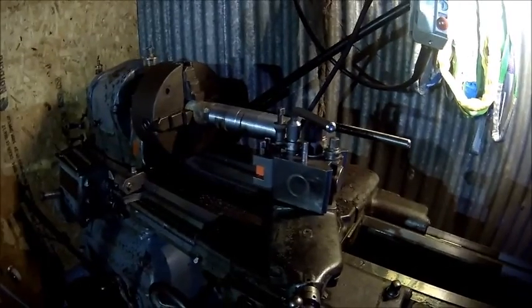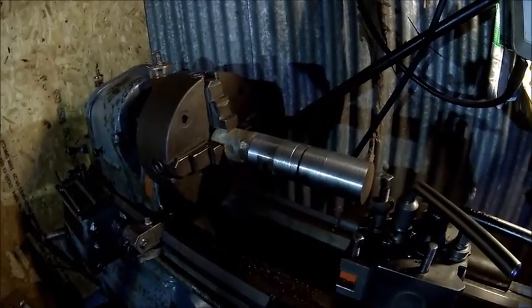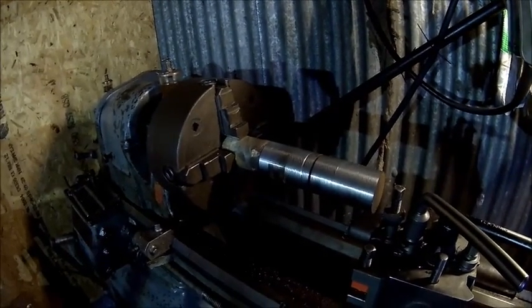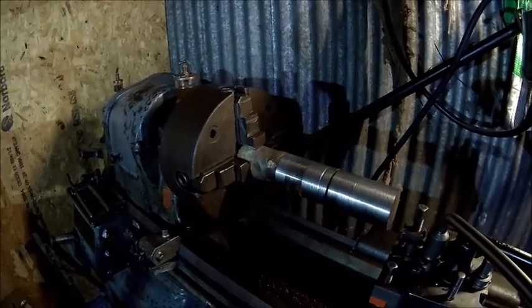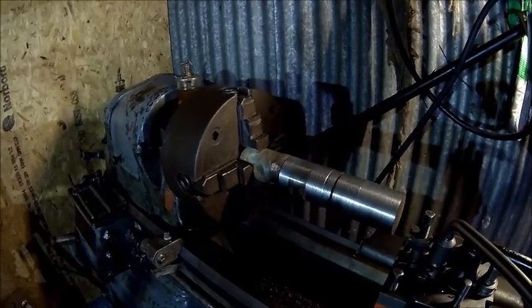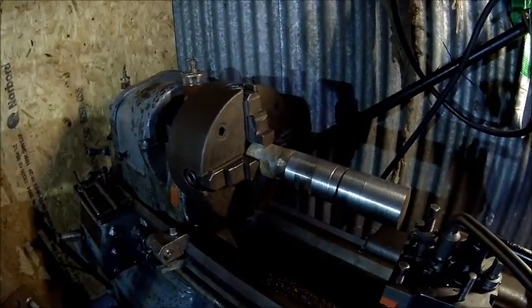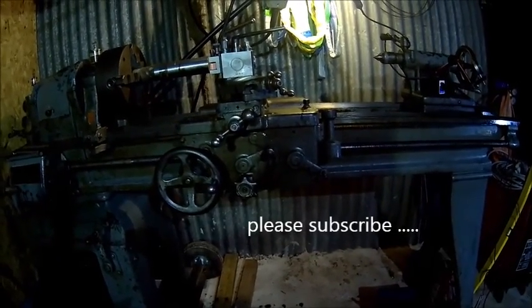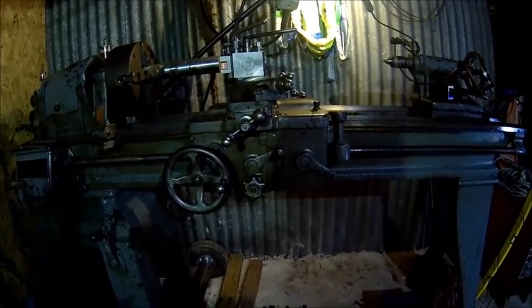Maybe we're gonna do some brake drums tomorrow - I've got some brake drums from my trailer which I need to machine. Let's try that. The chuck looks pretty good, it's a bit stiff, but I think it hasn't seen a lot of work because most people don't like independent chucks. I just like it because you can dial your stuff in as you want it - it takes a bit longer but you get it pretty dead accurate. That's it from the South Bend part 2. We're gonna continue that as we go along with the project. Thanks for watching.